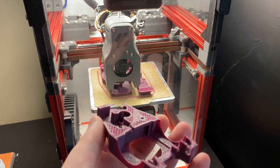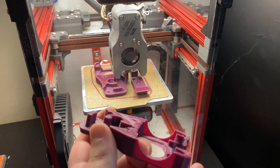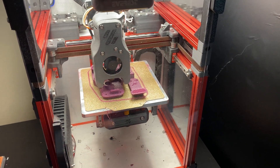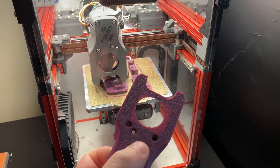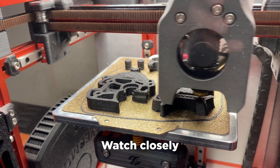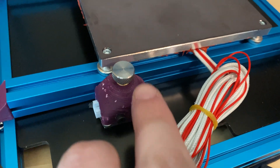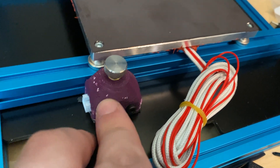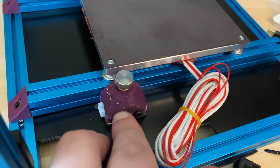The two issues I wasn't able to fix: one has something to do with the tool head's travel. Basically the printer does its movements, and if you're printing something like a curve or a circle — which requires a ton of commands to be sent to the MCU, because you don't represent curves in G-code for 3D printing — it means you have to send a ton of commands in a short period of time. I think there's a communication issue, and basically the tool head stops for a second and then continues, which causes some zits to appear on the sides of the prints. I think this has something to do with the Duet Wi-Fi, which wasn't in the world's greatest condition. It could also be a USB cable, but I did try replacing the USB cable and wasn't able to fix it.